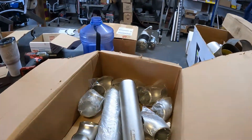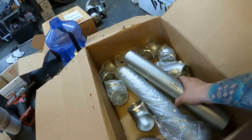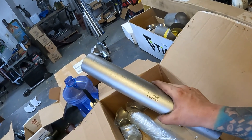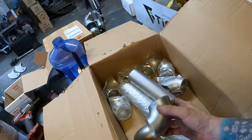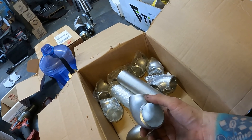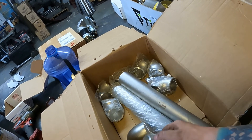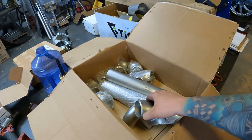Today we're going to show you how to build a turbo manifold. The first thing we're going to do is build our collector. We got some nice schedule cast stainless pieces from our boys over at Treadstone, some nice little weld ells that'll be our manifold tubing — three rotor 20B using some nice extra big stuff, two inch pipe tubing.